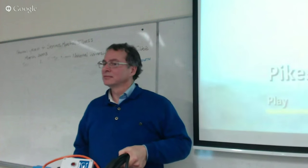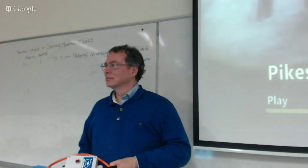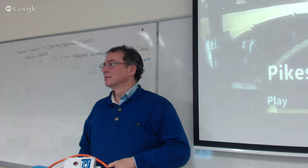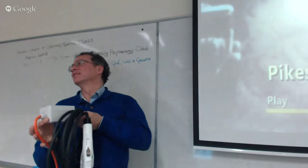The other problem I had was if I drove some distance to a friend's place close to me, I'd have to plug in and charge there. The Nissan Leaf uses a 15 amp plug, and most people don't have 15 amp sockets. And in fact, 15 amps could actually draw 18 amps at times, so you've got to be very careful. So I looked on eBay and found this device, which I can put in the car and use with a standard socket at home.